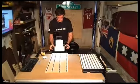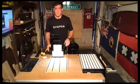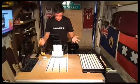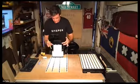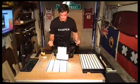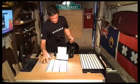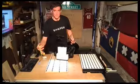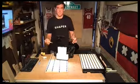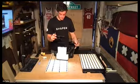Once you have a piece taped up, you're literally going to scan in that workspace — if it were a whole four-by-eight sheet, you'd move the tool around to scan the entire piece. The idea is to scan so you can see your entire workspace; it's literally taking a panoramic photo. There's a camera built into the front of this machine that recognizes all those dominoes attached to our workspace.